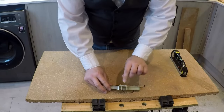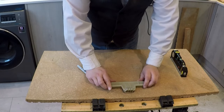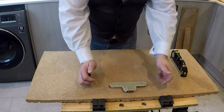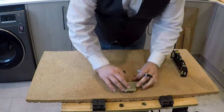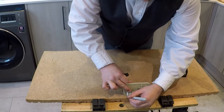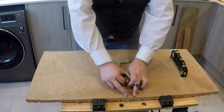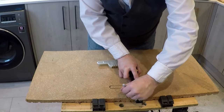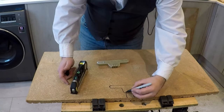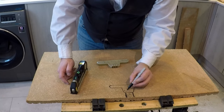You notice here there's three slots for wires. What we need to do, we need to cut a channel in to make sure the wires can be accessed and bend round okay. So what I'm going to do is cover up the vent like so, and we're just going to mark off where these channels are, here and here with a Sharpie, like so. We're just going to make a channel all the way up. And that's our channel. That's the bit we're going to cut out on this.